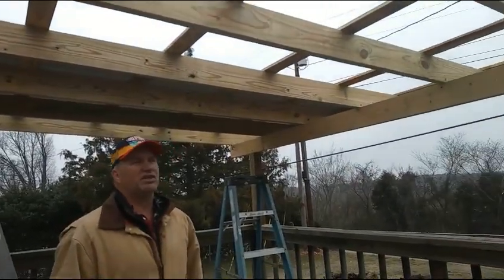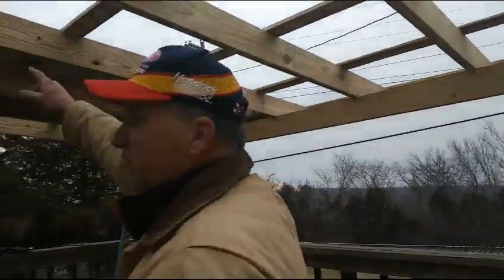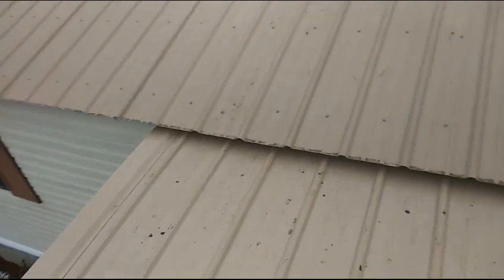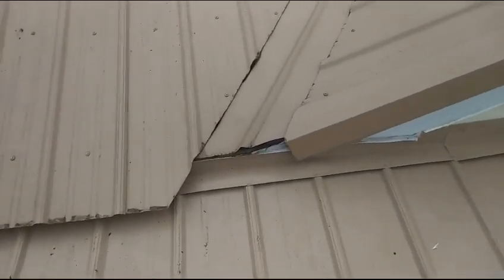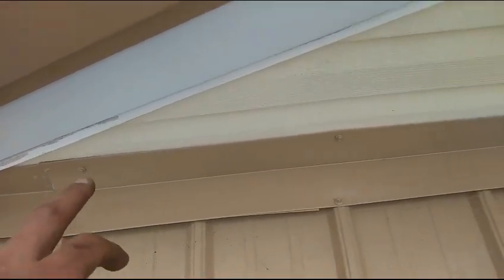We've got two-foot centers and everything's screwed. We're going to use a sawzall to cut off the overhang and put metal on. Screwing it all together — no nails. Now it's all sealed up. Got the rake and corner on. Put the edge on to keep any driving rain from coming up. Sealed the top with caulking, screwed it into each of the ribs — got every other one. Had to unscrew the roof at the top and peel it back to get the screws underneath, then fastened it all back down. Now it's done.